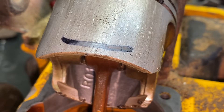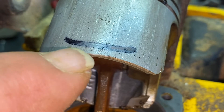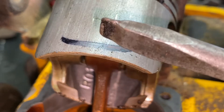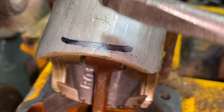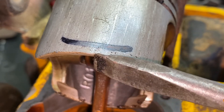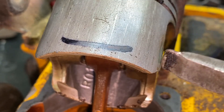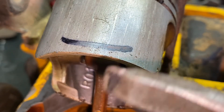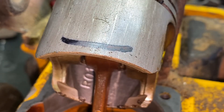If you remember earlier, I had you mark the exhaust port with our marker so that we can see exactly where it lands on the piston. You can see there's a little bit of room here, but we never want the bottom to open up into the exhaust port. Right now this is where the bottom of the exhaust port is at top dead center. But if we go too far, we could potentially open up this area into the exhaust port, and if that happens we could have exhaust gases trying to come in and mix into the crankcase — and we could also lose some of our charge from the crankcase out of the exhaust port. It can severely compromise the performance of the saw. There are situations where it does work, but on this type of build it is not a good idea.